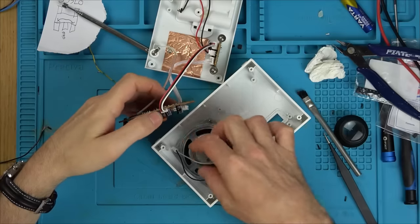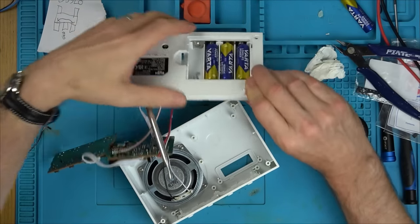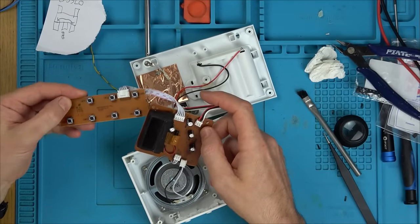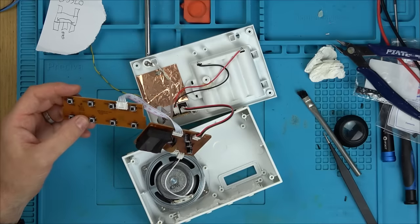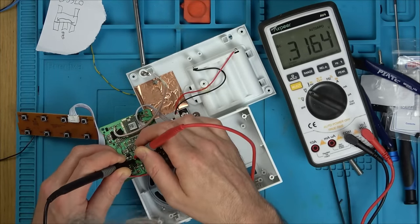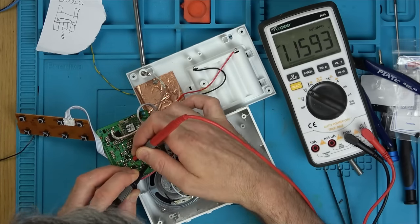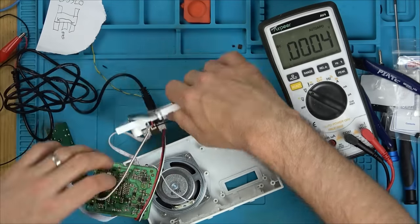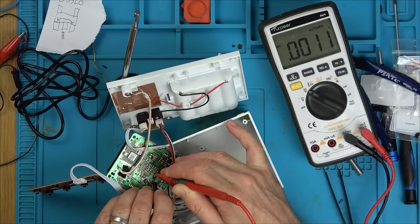It's on — let's give it a test. Nothing on here at the moment. Turn it on. No, not working. I checked for voltage on the output and it's incredibly low. So I'm going back to CPC to look at another voltage regulator. Some of them had 'enable' on that pin rather than 'shutdown', so maybe I need to enable the chip rather than have a fancy shutdown.